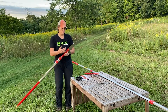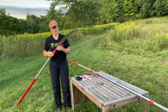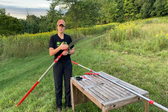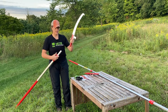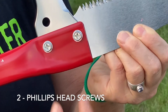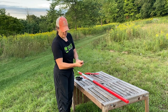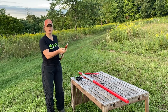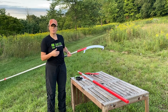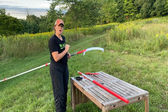All the blades are replaceable, which is great. The other neat thing that ARS has done with their universal head system — whether it's the 33, the smaller 23, the 45, or the 55 — is that all of these blades are interchangeable for all the heads. So if I wanted to use this head on my 55, I could easily do that with just the quick pins in reverse. It gives you, the operator, a lot of flexibility — say you had different heads for different types of work in the course of the day. If you were going into a tight columnar red maple and then into arborvitae or some ornamentals later, you could easily have another adapter set up with a smaller blade already ready to go, which is pretty sweet.